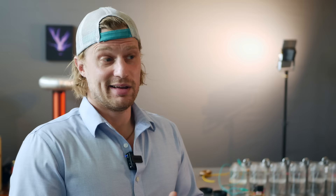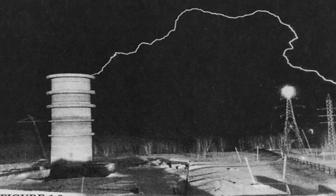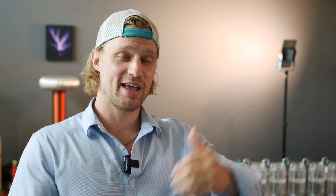You're looking at a water-based Marx generator that's capable of producing 100,000 volts. Marx generators are flat-out brilliant. They're a type of impulse generator capable of multi-million volt discharges, primarily for simulating lightning strikes on airplanes, cars, and whatnot. They're fully scalable to any size, and the largest spark on record in the history of the entire world was 150 meters long — and that was from a Marx.